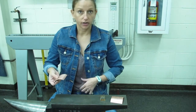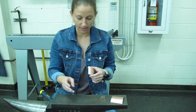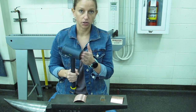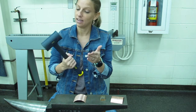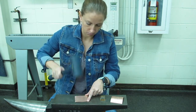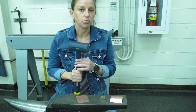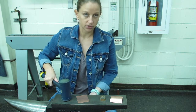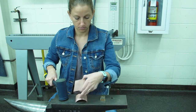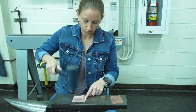Our last step before sawing or annealing again is that we need to flatten it. Our anvil still has little nicks from doing mokume-gane or blacksmithing, so you want to make sure that your pattern is faced up. Then you're going to use the dead blow hammer — which is rubber so it's not going to mar your piece. Make sure there's nothing sticking to the rubber like a little piece of metal. Go straight down with your blows. This is called a dead blow hammer because there's shot inside of it — whenever it hits, instead of recoiling with equal pressure, it hits dead straight on your piece and does not recoil. Do not put your fingers in there — you could get a really good blood blister.